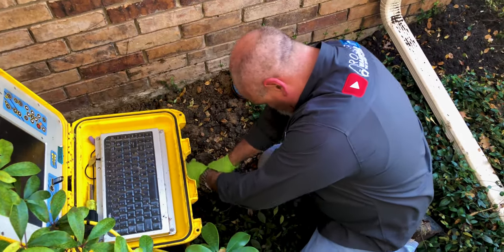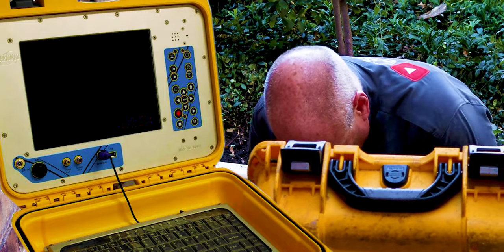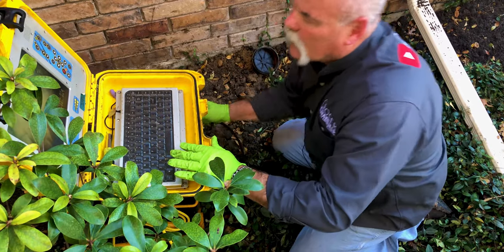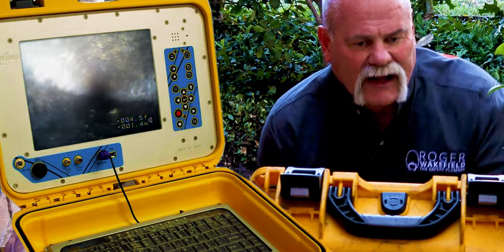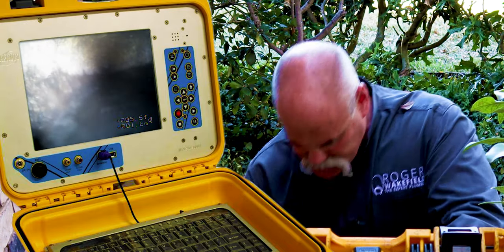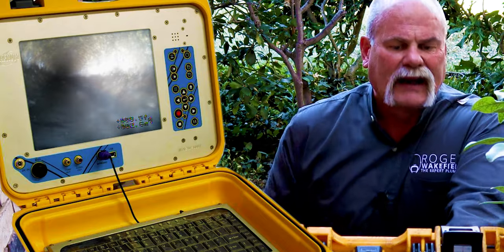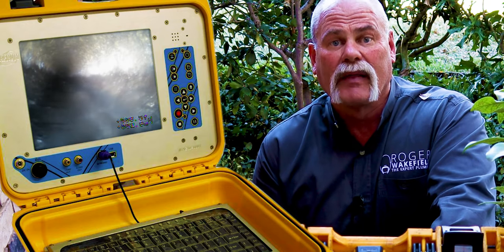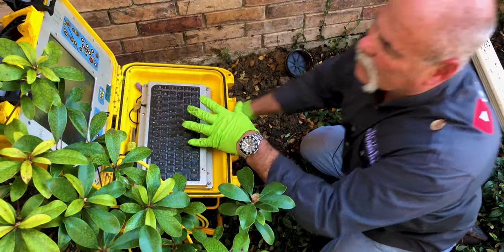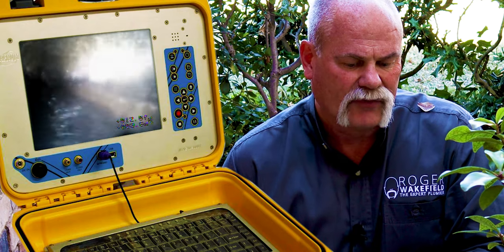So what I want to do is make sure I can get my camera in and go in the right direction. I am going the right direction. The problem is I've got something right there that doesn't want to go past — now I got past it. So that tells me there's probably a break or something. As I go down it, I'm headed out towards the street, and I can tell it's falling the right way because see that water running along the bottom? That's from having the camera and the cable land under the water, displacing it and making it run down the drain. I'm just literally going all the way through the sewer line out towards the city tap.